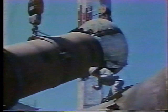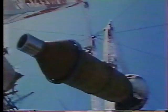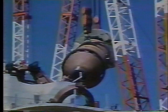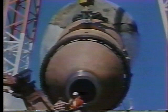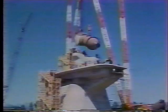Some doubted the calculations. The shaft was tilted to the required angle; telephone control was established at each winch house to ensure one derrick did not get ahead of the other. Clearance between the derricks was not enough to pass the load straight through, so it was angled between the two booms. Once clear, the shaft was cautiously drifted south — the worst point for this two-derrick lift. The gallery increased in numbers as the lift started down to enter the tail bearing housing and to land the sphere on the jack and hydropads. Here, in unstable equilibrium, it twice slipped south and had to be blocked until the yoke weight could be added.